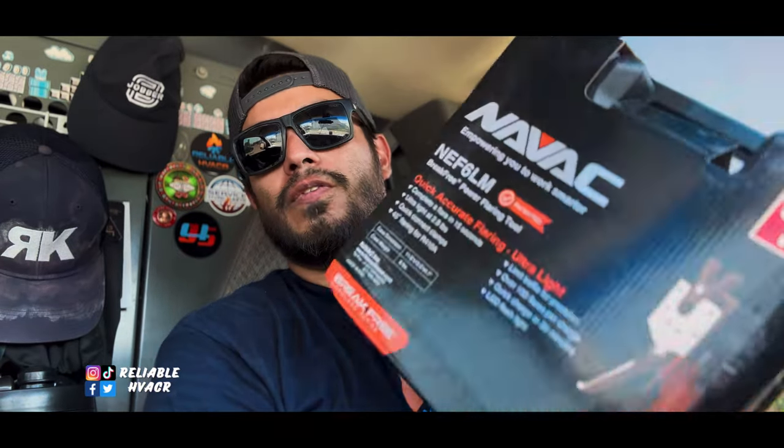I'm going to start using flare dryers mostly because of him — they're easier to put in, remove, and replace when I'm not brazing. If I don't have to braze anything, if we're fixing something else, I can go in there with a flare dryer and do it easier and quicker. So that's why I got this one. They also have a bender and a swage toolkit — battery-powered — that I'm super interested in, but we got to pace ourselves, one tool at a time.